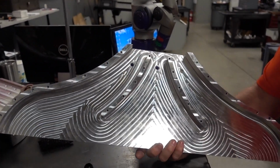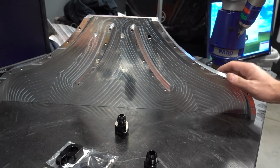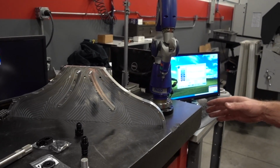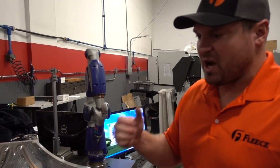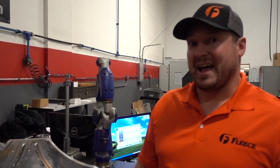Chase spent a lot of time on the dyno on the UCC truck and our sled pulling trucks to figure out good air distribution, figuring out how to get balanced air to all cylinders, because if some are starved for air, they're not producing like they could. So these flow dividers in here really do the job. He was within 50 degrees across all 6 cylinders on the dyno, at 2,000 horsepower. So it's a big deal.